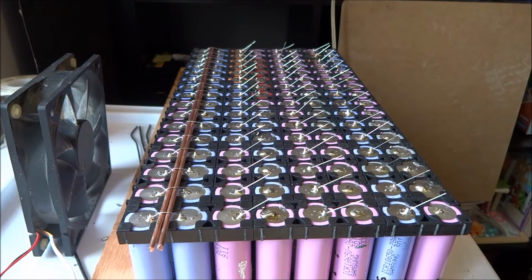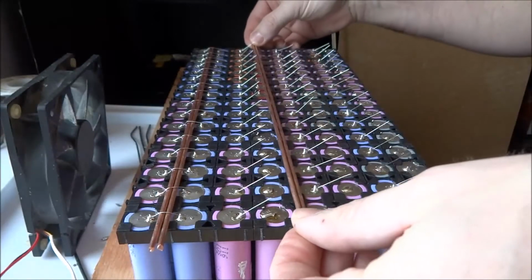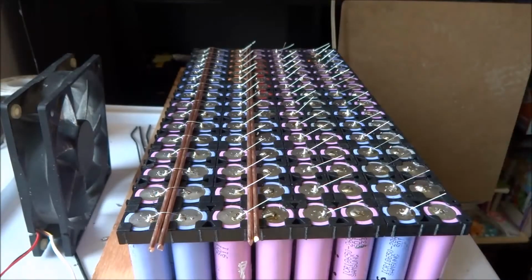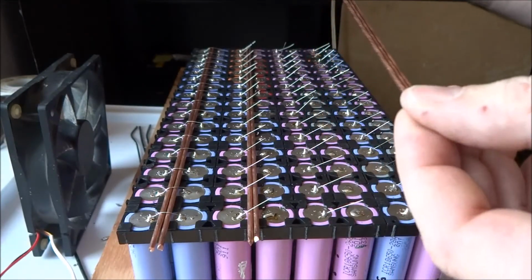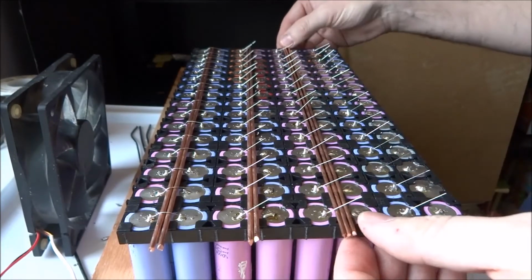Now these are 2 10 gauge. You can combine different wire sizes to gain the same result. The wires that I use, like I indicated before, are household wiring. They have 3 conductor 10 gauge, but they have a ground which is 12 gauge. So instead of wasting that, I can combine 3 12 gauge wires, and that has the same carrying capacity of 2 10 gauge wires. So I'll put that here, and it'll work just the same.